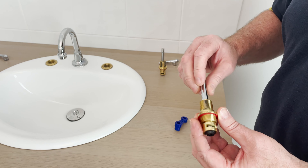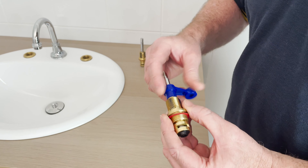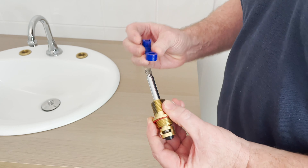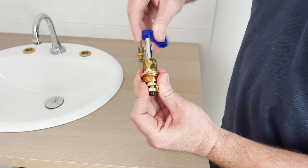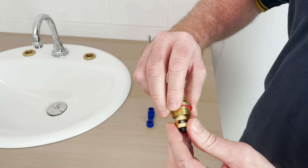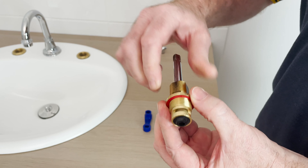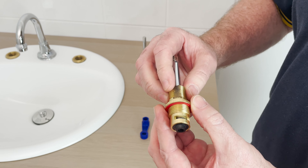Here we've got a Maxxis straight out of the box. It's always good to prepare the spindle before installation, so it's good to turn the setting screw a bit. You can use the other end of the key to move the head, and you can see internally that it's moving up and down nice and smoothly. It's always good to wind the head into the spindle, so you're always going to install it with the head at its highest point — quite a simple operation.